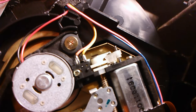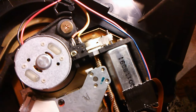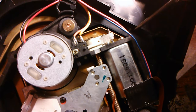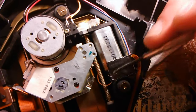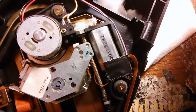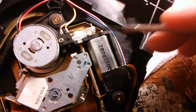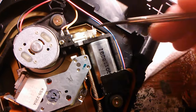And I've seen people try to re-grease them up. That is not smart to do because it's just going to get stuck again. So if anybody's watching and listening to this and your gears get stuck, don't keep greasing them up. It just makes things worse, because I've seen grease in all kinds of areas from people doing that for these gears. And then part of it gets on the lens and it usually ruins the lens. So don't spray it with WD-40. Don't put new lithium grease on that. It doesn't need it, just change the gear.